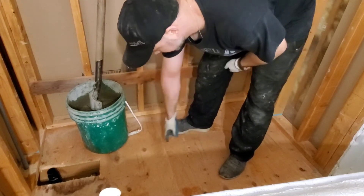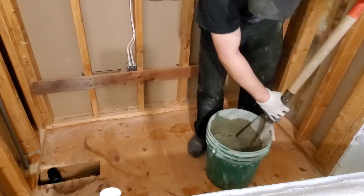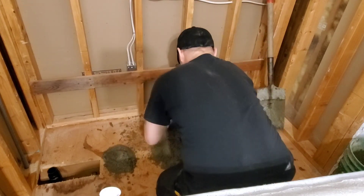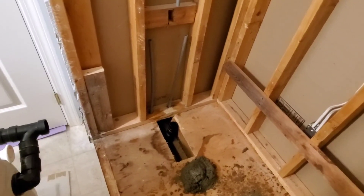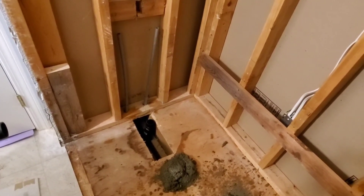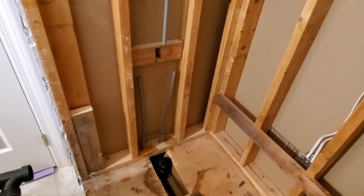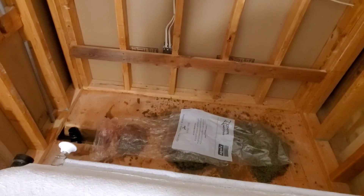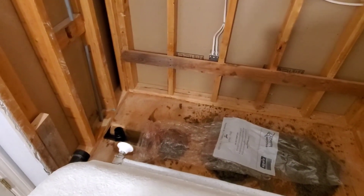I've marked the rails underneath the tub and I'm going to put concrete here, here, here, and in the back. I removed the diverter. I'm going to get the tub into position, glue this and this, and then in one big swoop attach the drain. Once the drain is attached, I can work on leveling the tub. In case you're wondering why I left the water on for so long, it's because there are other people in this house and I can't leave the water off for a prolonged period of time. I put plastic as a barrier between the tub and the concrete — it'll make the tub easier to pull out if that time ever comes. Now I'm going to glue everything and get the tub in as fast as I can.